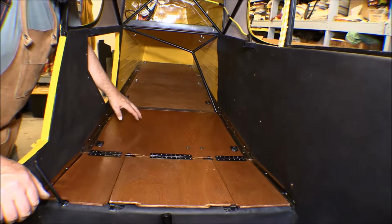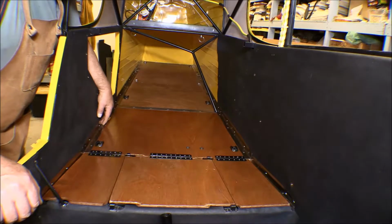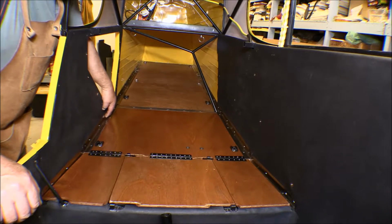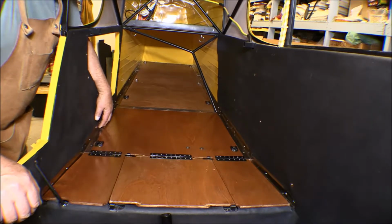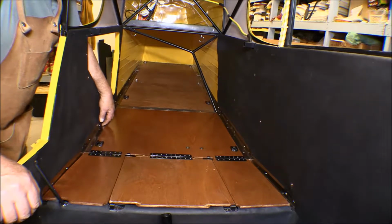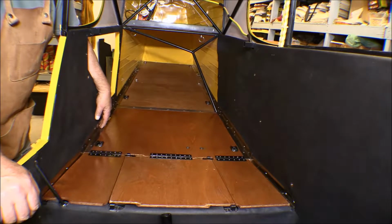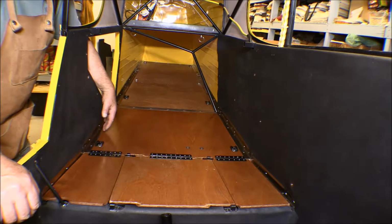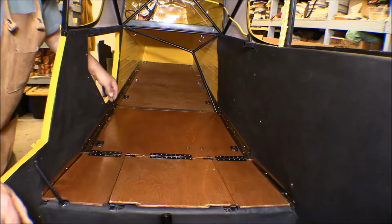I've got the floorboard. It's been in, but I didn't have it screwed down. I only had one screw holding it down because I didn't have these trim pan pieces on here. I've got these stainless steel angle brackets put in here and screwed down. That helps hold everything together, and it makes this more liquid tight. It would haul stuff that has moisture in it, sometimes game bags with meat in it, and of course all the paraphernalia that goes with doing the fish surveys. So you do get a lot of gritty stuff in there, and this will hopefully help keep all that gurry and grit from going down through the side of the airplane and getting down in there where it'll start stinking and rotting.